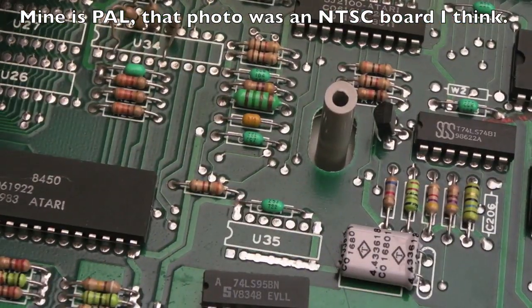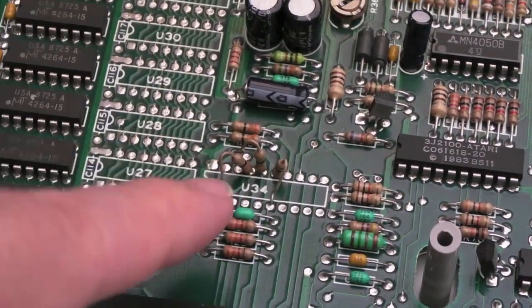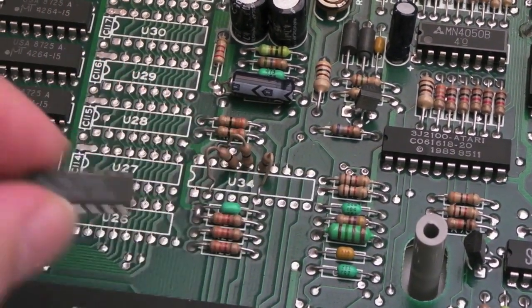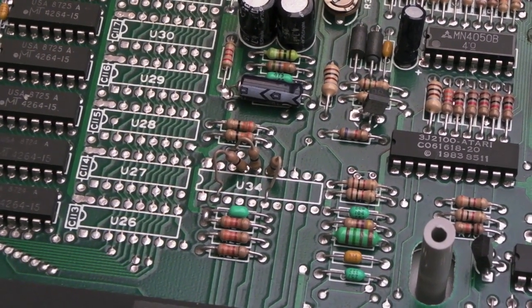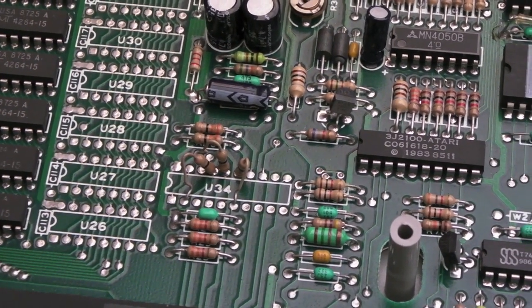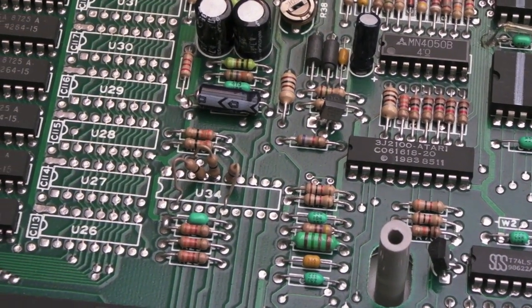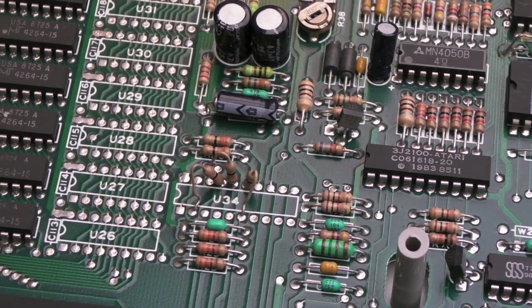I think I'll start by socketing up, getting some sockets for the DRAM. We'll get a socket in there and remove those resistors — I'll make a note of where those are, take a photo, just in case I have to put them back if I can't get this chip working. It's supposed to be new stock. I can go into the memory test — the standard built-in self-test — to see if that shows any difference in behaviour. I've not got a tape port or disk drive, but I have got a disk drive solution coming, which will be a future video.